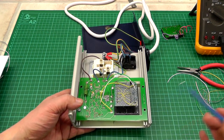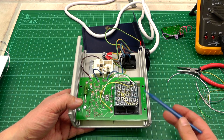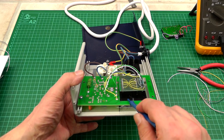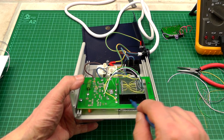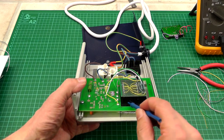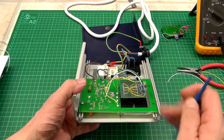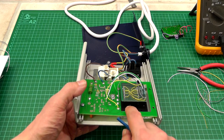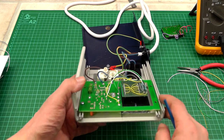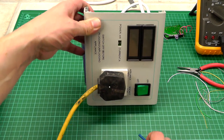One thing I had to do was calibrate: I didn't want to spend all day choosing the exact resistors on the voltage dividers, so I put in some nominal values. The DVMs themselves have a span pot on the back, but it's quite a coarse adjustment — it swings from almost one end to the other, so it's quite hard to get it spot on because it's so sensitive, which I wasn't expecting. I used the span pot together with the nominal voltage divider values to calibrate the display to 1.9 amps and 0.44kW.